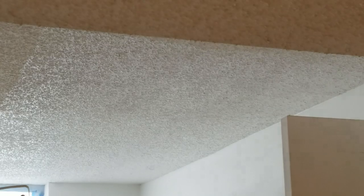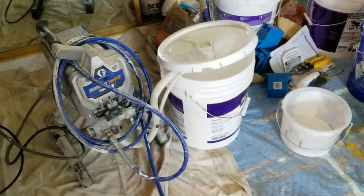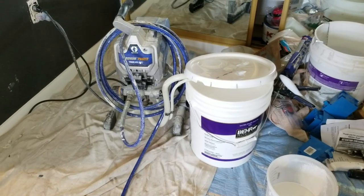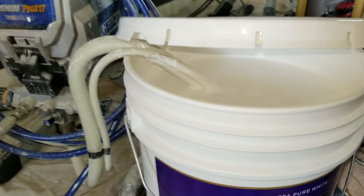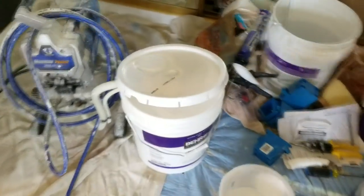You can see here what we're doing is overlapping patterns going east-west over a few square feet at a time. We work in small sections. When we come back you can see we're going north-south, and you see how it blends in — we feather in and overlap previous spots we already did. There's our setup here in the other room. We prefer to do it when it's completely empty, with everything all laid out and protected, cloths spread out everywhere. Here of course it's completely bare — concrete floors — so we don't really have to be too concerned about covering a whole lot of things up.